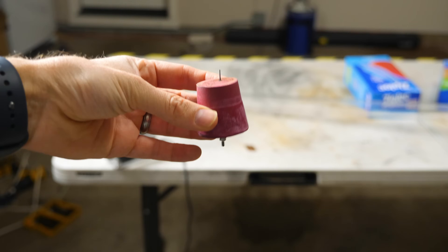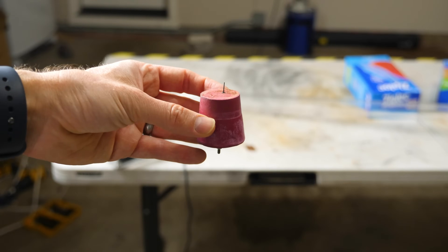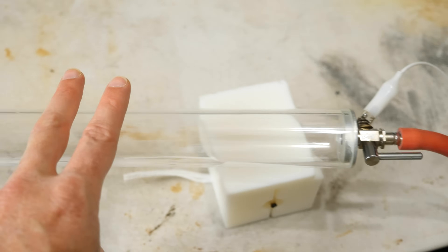So if we want to use these Tesla coils to power something at longer distances, we just have to have it at lower pressure — like the pressure higher up in the atmosphere. What I've done here is taken the needle from the top of the Tesla coil and stuck it through this stopper here. Then I have a long tube that goes to my vacuum pump, so I'm just going to be pumping out the air from this tube, and the other end is going to have the Tesla coil pin.